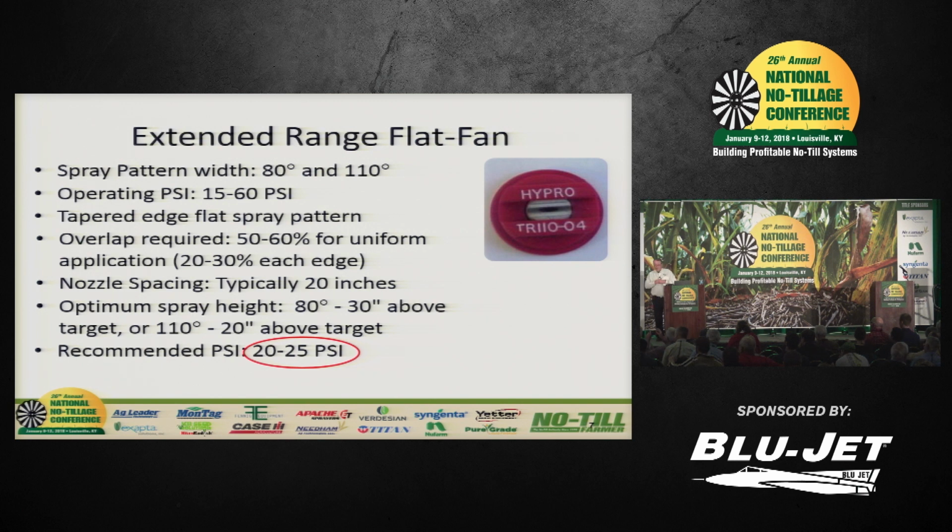Optimum spray height, that's crucial. In fact, that becomes a very important category in the dicamba discussion, and I'll focus on that tomorrow. The last line there says recommended PSI. Now that's based on the 30 years of experience I've had in doing research and studying how to best use these nozzles to achieve our best pest control while at the same time minimizing spray drift. Thus, I've developed the nozzle sweet spot.